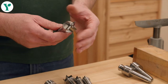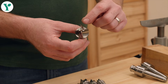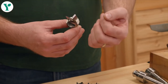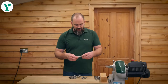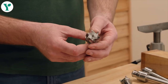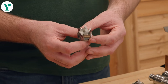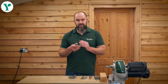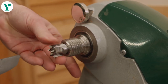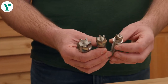They also do the traditional four prong drive centre, but again they go up to some beefier sizes — 32mm for some bigger material — and they do some smaller ones as well so you can get in closer to the ends. The four prong drive has worked for many years, but for pieces that are a bit more problematic or you're concerned about gripping, they've now also done a six prong drive centre. The opposing prongs are at different angles so that mathematically it's less likely to give you an issue with the timber coming apart or splitting. They do that one in 32mm, a 22mm, and a 16mm.